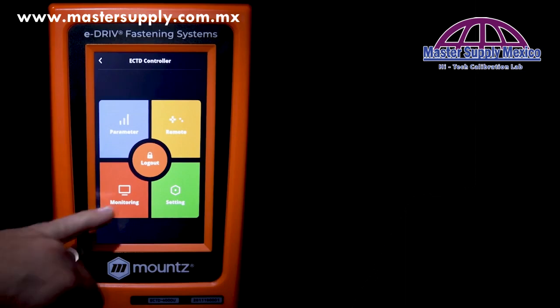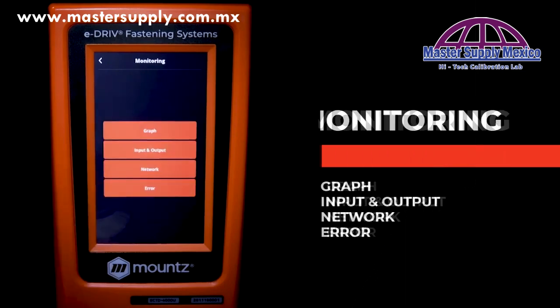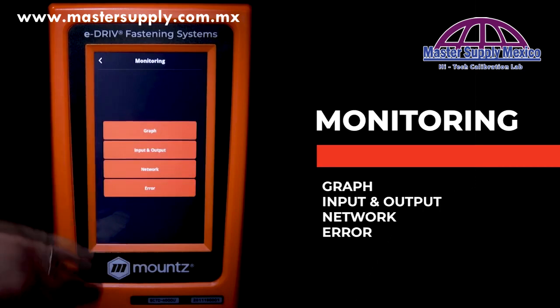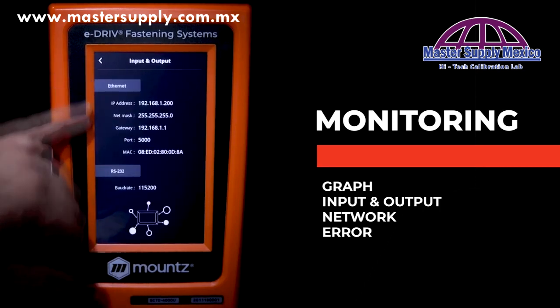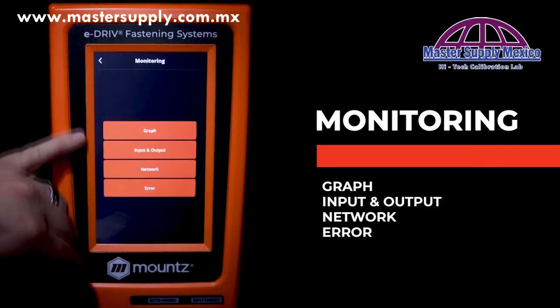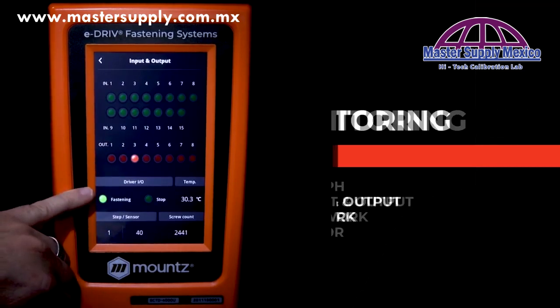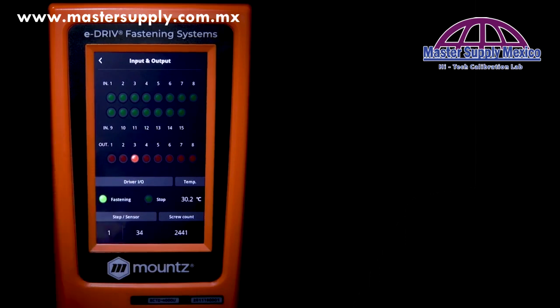Let's look at the monitoring tab. Here we have some functions that allow us to look at the last 8 errors that were generated by the system. We can look at the current network settings. We have our input and output. And this helps with the communication to make sure that we have that wired correctly. As you can see, I have output 3 set to driver ready. Output 4 is set to driver run. So we have those signals.